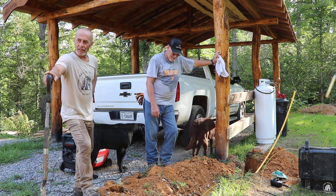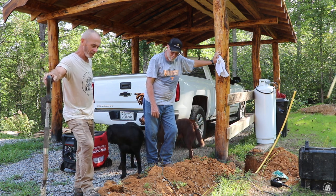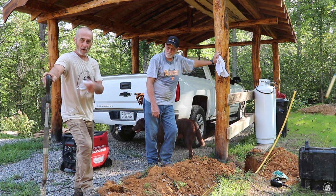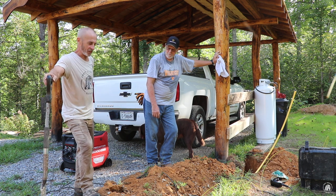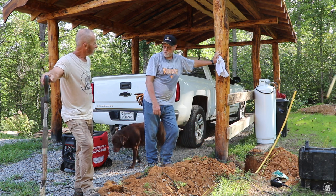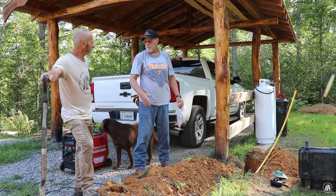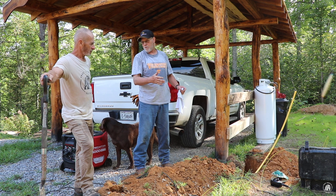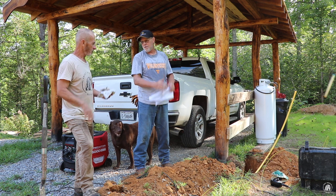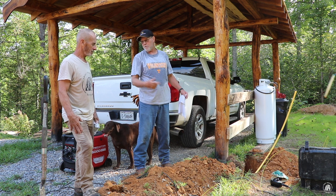Now, he actually helped me hook up the other cabin that I built about 25 years ago. We've also put a wire in there where I can locate it. What are you fixing to do here? It's called butt fusion. All it is, you heat the pipe and fuse it together. We got a machine, we set it in, we trim it, make it uniform, and then we heat to 500 degrees, set it in there, meld it, and put it together. And it should be like a steel weld. The pipe should break before the weld does.